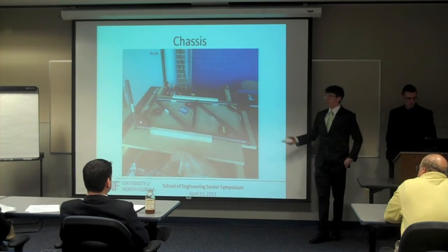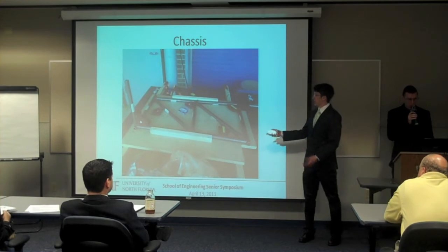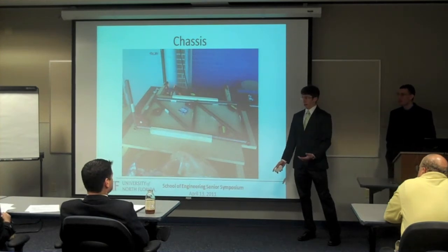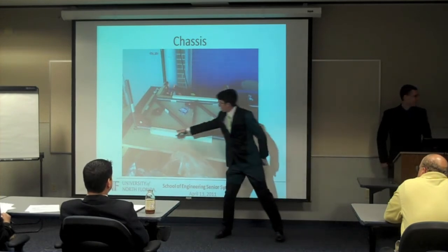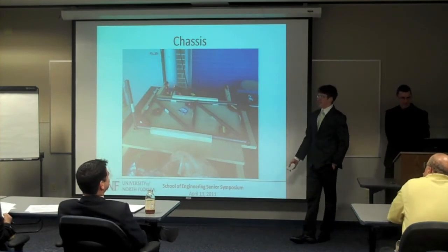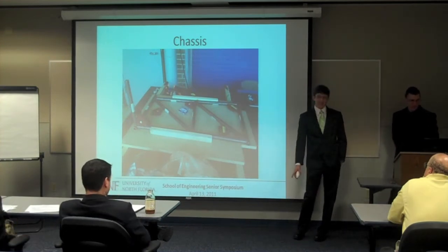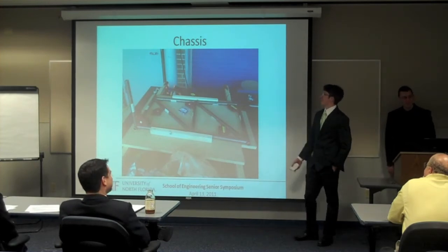Chassis started with the bottom rail. You take the bottom rail and lay it all out in X and Y using wooden jigs. One thing that made it a little more difficult was that we didn't design for manufacturing — none of us had taken the manufacturing class yet. We thought this angle would be 90 degrees, but it's actually 88.3 degrees. That was a difficult process. Myself and Justin did this piece three or four times because we couldn't figure out why it wasn't lining up. It turns out it's 88.3 degrees, so lesson learned.